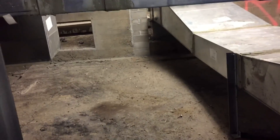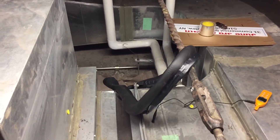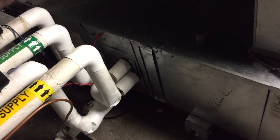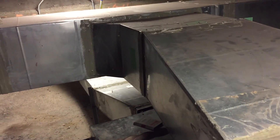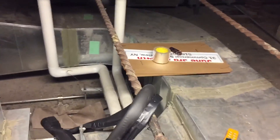When I was here about two weeks ago we went through everything in this unit. The first things to check when they say there's no airflow: we checked the filters — they were fine; blower speed was fine; tightened the belt a little bit but it amped out good, so we appeared to have good airflow leaving the unit. Within the unit there are a bunch of fire smoke dampers and we visually confirmed they are in fact open. For all intents and purposes this unit is sized correctly — we should be cooling the space and it is not.